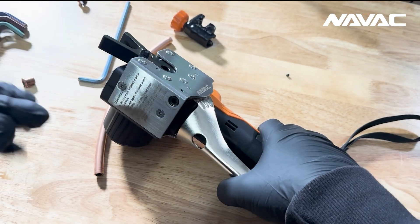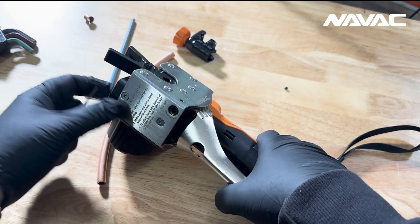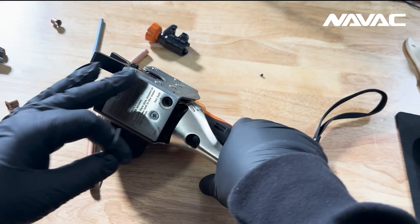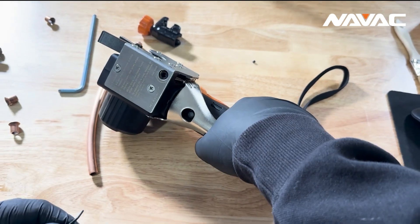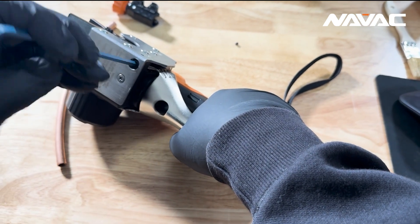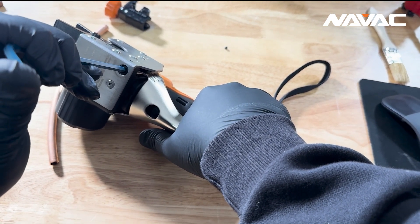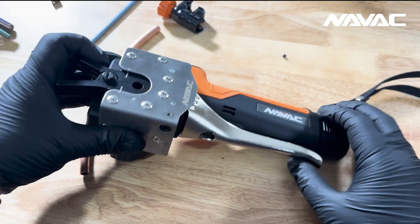You can do this two different ways: you can make very small, minute adjustments and then reset and test. What I like to do — and to me a little bit more dialed in — is to actually apply the type of pressure that I would expect to close this tool and maintain that while backing the adjustment screw out. So I'm going to very slowly go counterclockwise while maintaining pressure. Right there — it really didn't take much to get that dialed in.